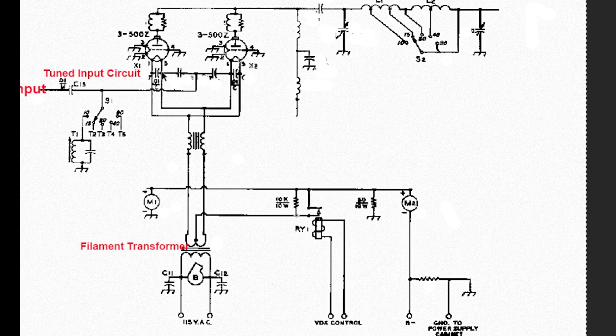But now we've got RF going onto the filament. To keep that from going down into the transformer, there's a choke — a filament choke. It was wound on some kind of ferrite. Early on the cores were a little bit different; it could be one that looks like a donut, or it could be a rod. This keeps the RF from going into the filament transformer and towards the power supply.